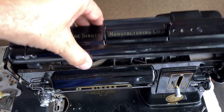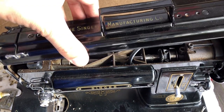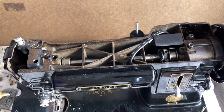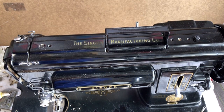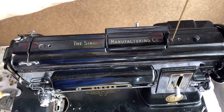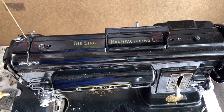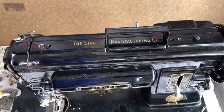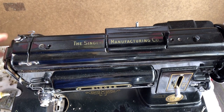That's one of the beautiful things about these. But from the restorer's point of view, I want to go in and show you the difference. If you've got the lid on the machine and you're going to oil it for a project, you would put one drop of oil in each one of the holes. There are three on the right and two on the left, one of which is for the side mechanicals.